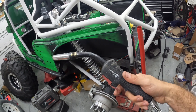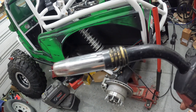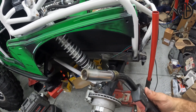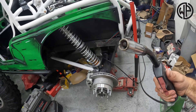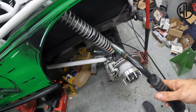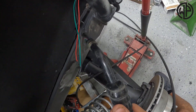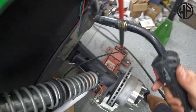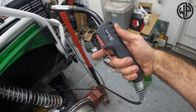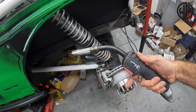Here's why: we've all seen the MIG torch. This one is well used — it's covered in overspray, it's worn, the tip probably should have been replaced six months ago, but it still works. Now when you're MIG welding, you need to make sure you're at the right angle and that you have room to get in there and lay a nice bead. The problem is the handle on this gun — space constraints become an issue and you get limited with your angle in certain situations.